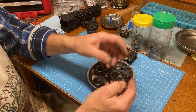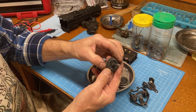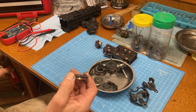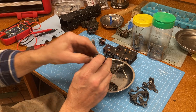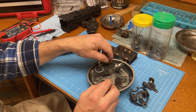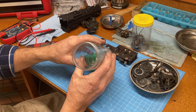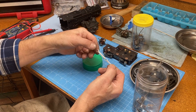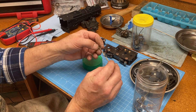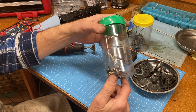Here's the rear wheel truck and the front wheel truck. All of the wheels and axles are grease-free — you can see that axle cleaned up very well. I'm going to take my little Dremel tool and wire-wheel the bright parts to make them shiny again. All of the connecting rods, driver rods, and screws have been through my cleaner. The chrome pieces I'm going to buff on a small buffer I have — that will make the chrome nice and shiny again. These have all been through the ultrasonic cleaner, so they're all grease-free and clean.